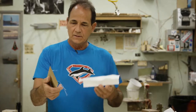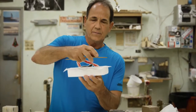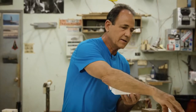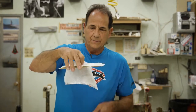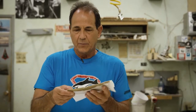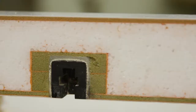Then we take this piece of PVC foam — it's really high density foam called PVC foam — and they vacuum this onto the board, and then they take another layer of glass and put it on top with epoxy. Now this is the sandwich right here. This is an engineering process to make the skin of the board stiff and impact resistant, and makes the whole board stiff. This gets done on both sides of the boards, like this piece shows.